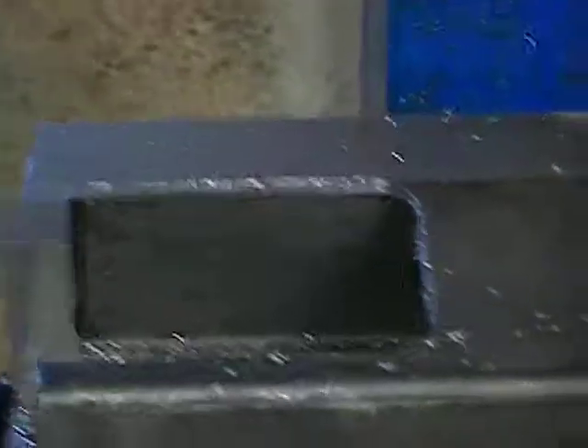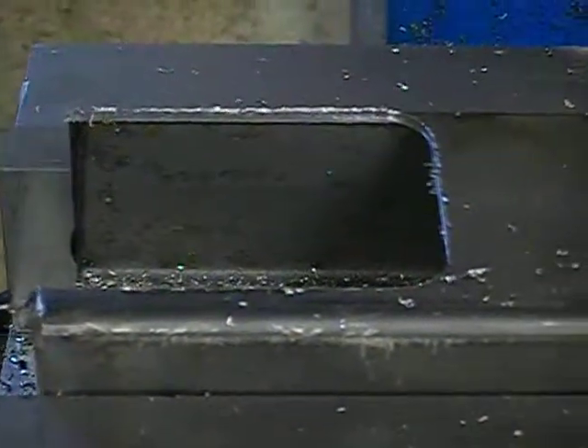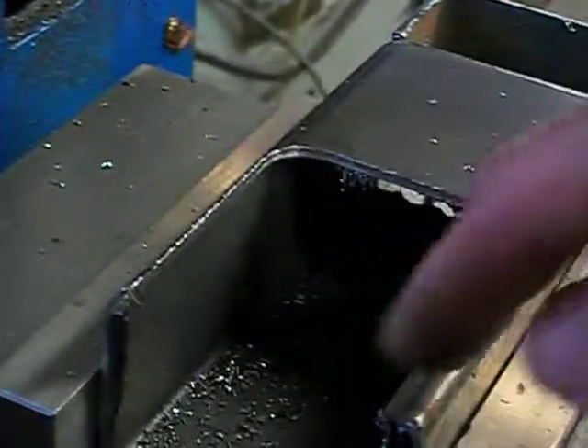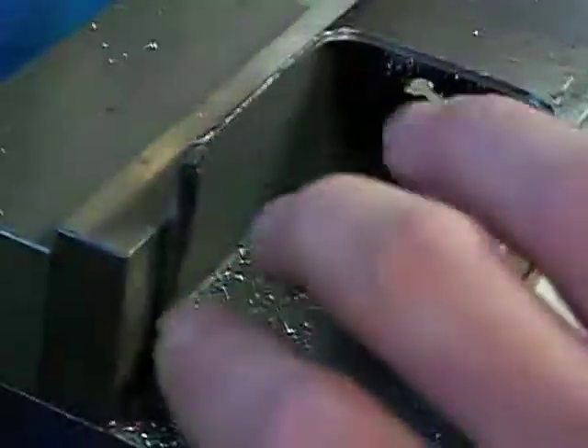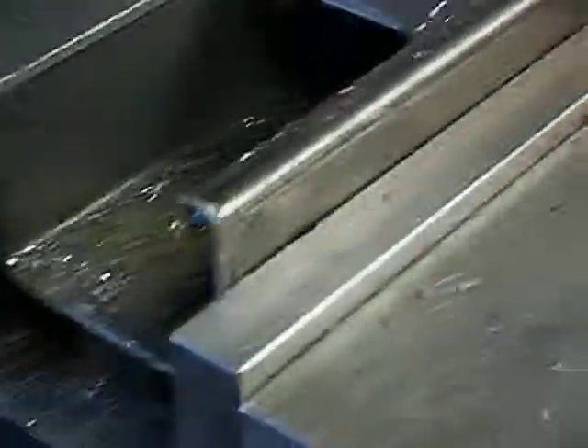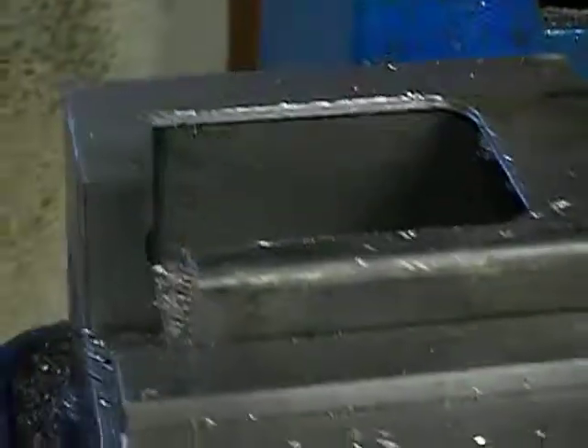Now over here, what I was doing is cutting out some pockets out of some pieces of steel to make some caps to put on the end of the rectangular tubing. You can see the rectangular tubing here. I'm cutting out some pieces to put inside the rectangular tubing so when we're done it won't have a hole in the end of the trailer frame. I've been using my CNC mill to do this — I was going to record it, but there was too much going on and I couldn't deal with the camera and run the mill at the same time.